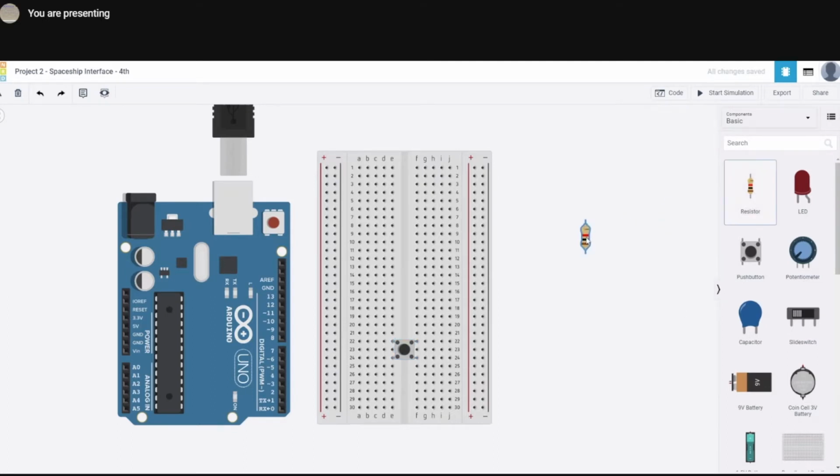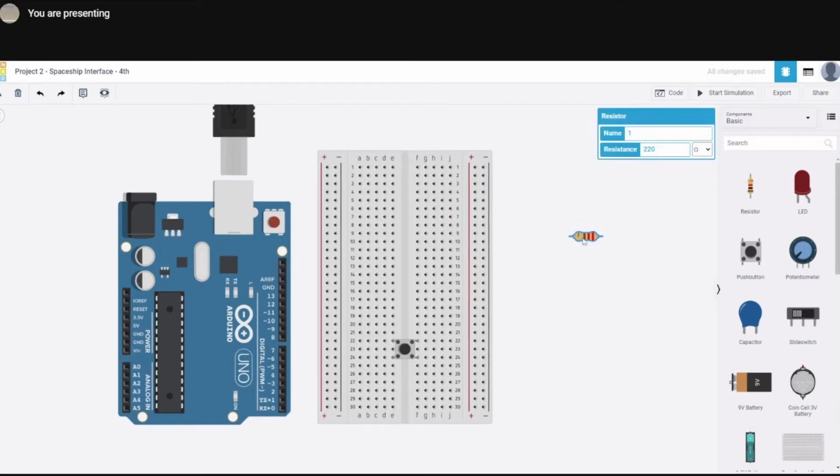And then I have 3 220 ohm resistors, 220. I'll rotate them. I'm going to make it look exactly like it. It's rotated like this. I wonder if I could copy it. Copy paste. Yes. Paste. Okay, I got 3. Then this is on pin 7. This one's on pin 11. And this one's on pin 15. Yeah, the spacing looks right.